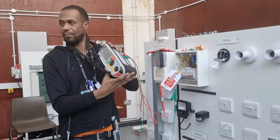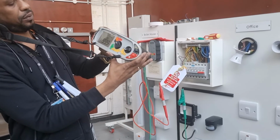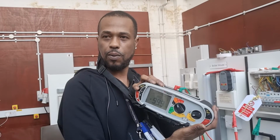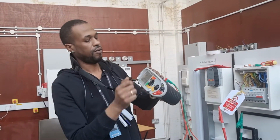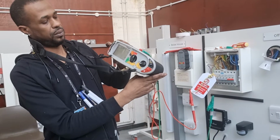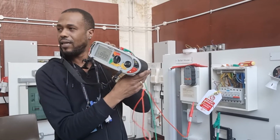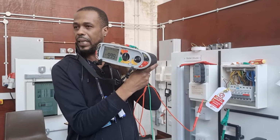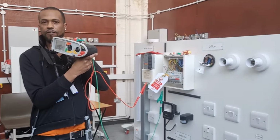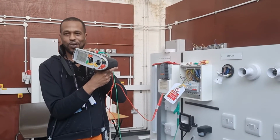Right. So now, one second. Why didn't that work? What did we put it on? 500. Thank you very much. So now we should be greater than 999 megohms. Yeah. Okay? That's what we want. If 500, no problem. 230 will have no problem.